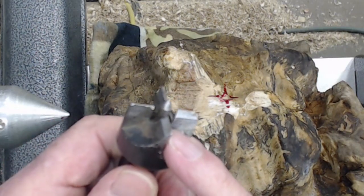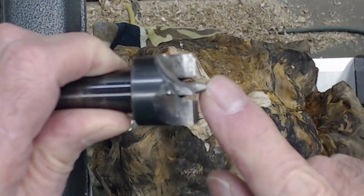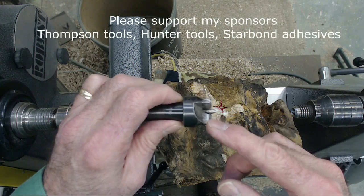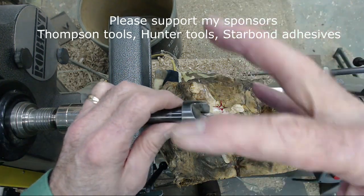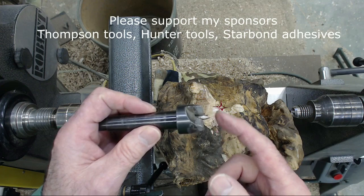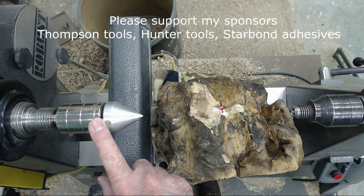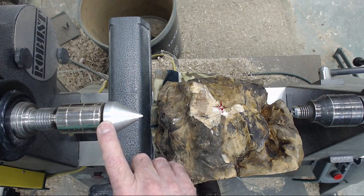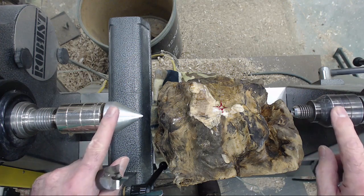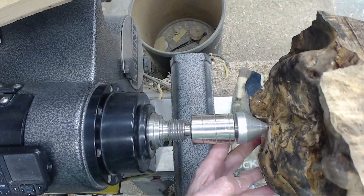While I'm trying to do the balancing, I want the pin to touch only so that the piece will freewheel and I can find that balance point. Once the drive center area hits the wood, then the motor, bearings, and belts all have to move and the weight of that will interfere with my balancing. So in order to get my balance point on a rough piece of wood, I'll take an old live center — some of you with multiple lathes have an old live center laying around — and put a live center in my headstock and a live center in my tailstock. When I put this on between centers it's just going to freewheel, and I'll be able to find my center point easier.